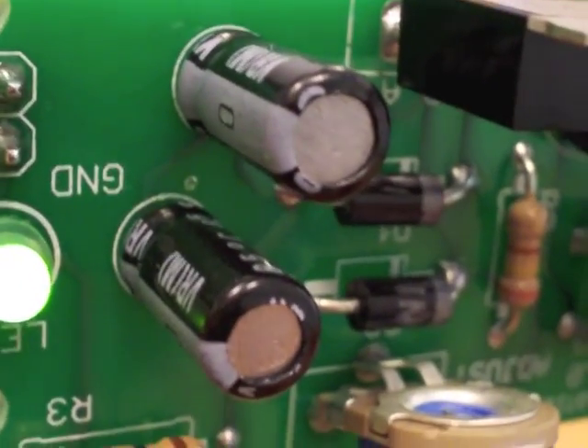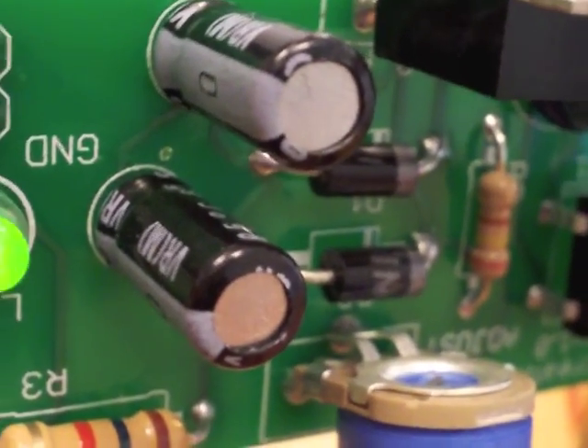The light went out. You can see there's an LED and when we go all the way down it turns off. Adjusting the potentiometer slowly, we can see it drops from 5 to 4, down to 3 to 2, and turns off. As we adjust it back up, the LED also comes in and out. I have a screwdriver in the potentiometer and it turns on and turns off as we adjust it. We've got a working power supply.